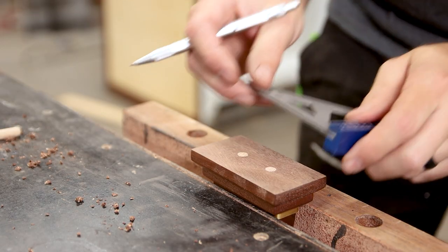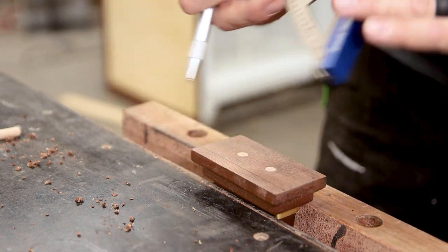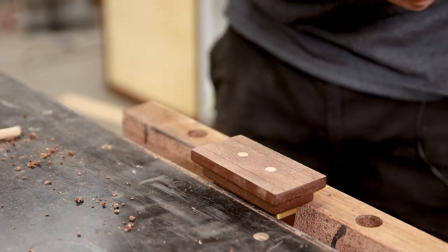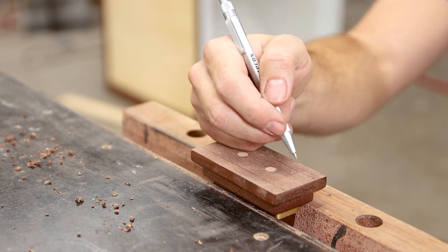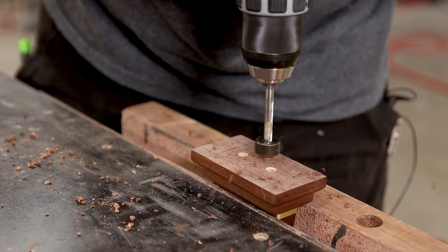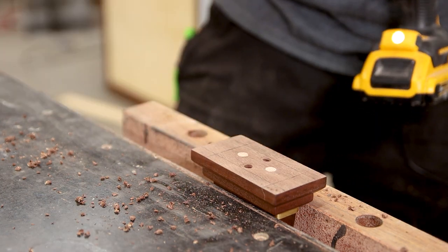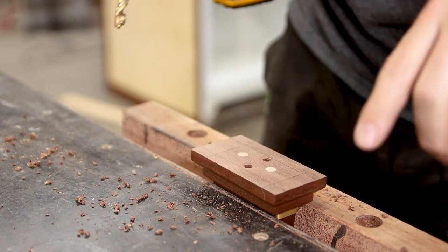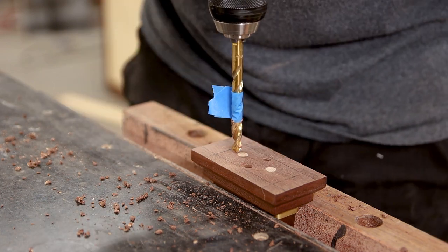We're gonna try to not only rely on glue, but we're gonna put a few dowels. They're gonna go into the door and the door supports. So repeatedly yanking on the handle. Hopefully it'll be good. Using two different size dowels for the sole fact that the little dowel centers I'm gonna use to transfer the holes, I only have two of each size, so can't really do four.